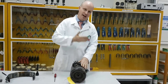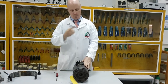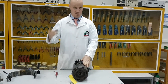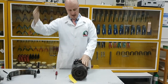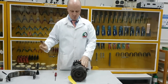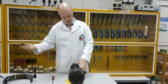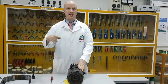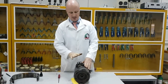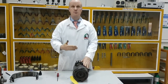So generally, that is engine start — the generator is a motor, so it's basically turning the engine. And once it reaches a certain speed, our engine becomes self-sustaining, or it's propelling. It will then kick over, and the external circuitry will stop providing electrical power to the starter side. It will then connect electrical power, and once it reaches that 28 to 29 volts, it will connect power onto the aircraft electrical circuit. That system is explained in a separate video.